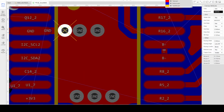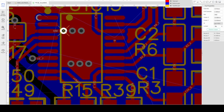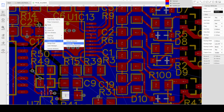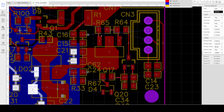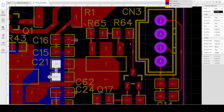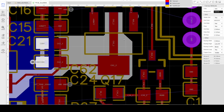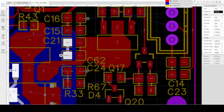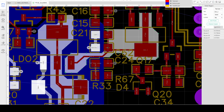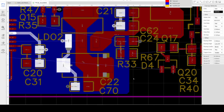The good thing about this EasyEDA design is that once there is a problem, it will be marked automatically and we can easily see if there's a problem with the PCB design. Another consideration is that during the layout, we can connect the shortest possible connections first and optimize later on which areas need consideration for noise immunity, power and temperature. Here, this one is the power switch and it will dissipate some power, so it needs some copper area or copper plane. At the same time, the LDO will also dissipate some heat, so it will have a ground plane and a power plane.